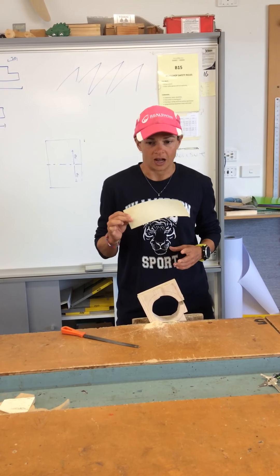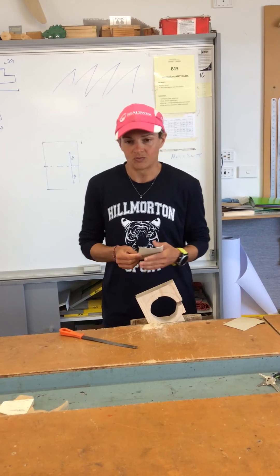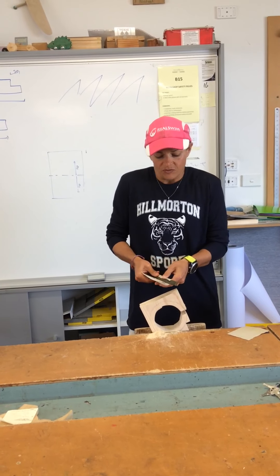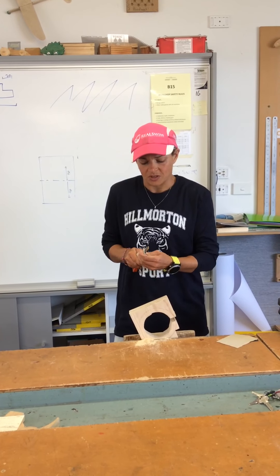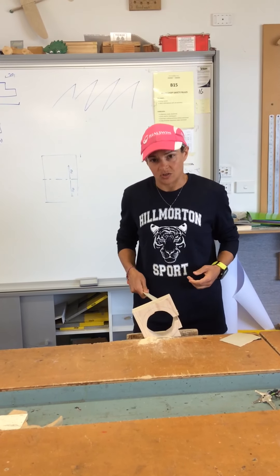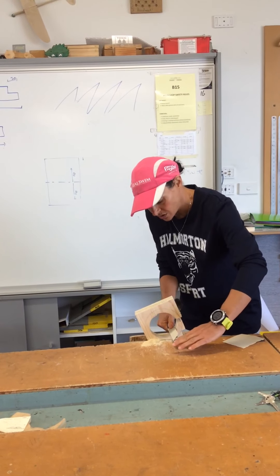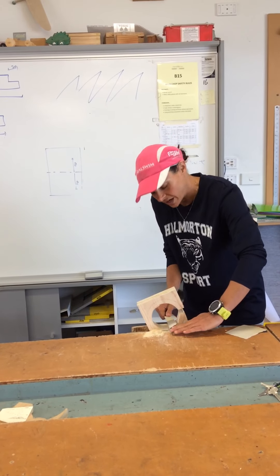Not the color — that is just the brand. So we're looking at the P number on the back. I'm going to wrap the file. It's helpful if I don't start with too large a piece, and as I wrap it I wrap quite tight, otherwise the sandpaper is not going to be able to use the shape of the file. Control hands, a hand putting a little bit of weight on, and I'm moving across the wood and also shaping along it at the same time — so it's almost a diagonal action.